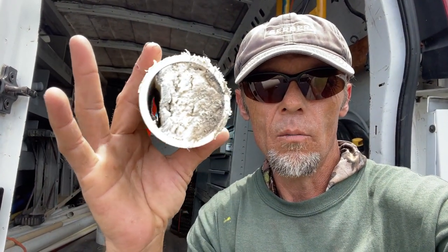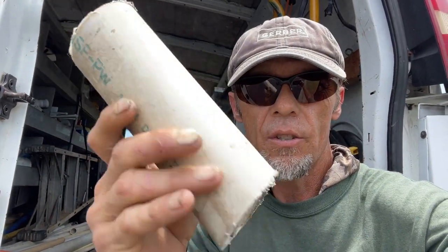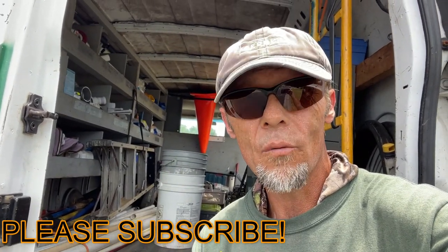Well, that's going to do it for this one. Thanks so much for watching the nastiness — tell me I'm wrong when I say the kitchen drain is hands-down the dirtiest one in the house. That's the number one cause for kitchen stoppages, besides food particles, garbage disposals, and hair — but grease by far is the number one culprit. Technically speaking, when a line is packed with grease that bad, you should get a high-pressure hydro-jet machine out to clear those lines. I'm just hoping there weren't big chunks that went down and clogged the main line. Let me know in the comments if you've ever run into a drain this nasty and clogged up. Until next time, don't forget to keep plumbing!